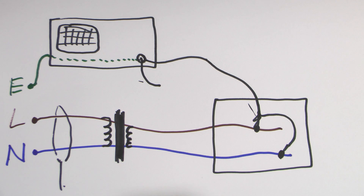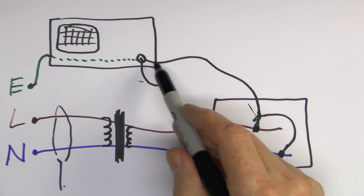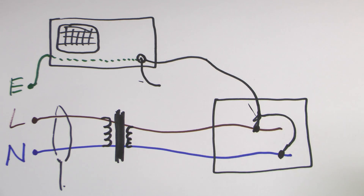It's important to note that you're powering the equipment you're testing with the isolating transformer, not the oscilloscope. As seen with the transformer in the other shed, the earth connection is still connected through - it only isolates on line and neutral, which is fairly common. And you don't disconnect the earth to the oscilloscope, because if you did, connecting to the line would make the oscilloscope frame live at 240 volts, and if you touch it, you will die.